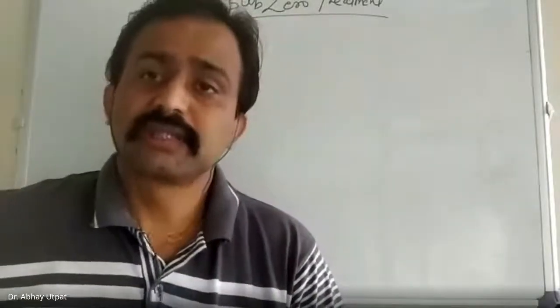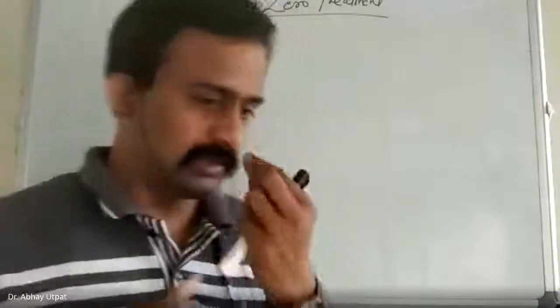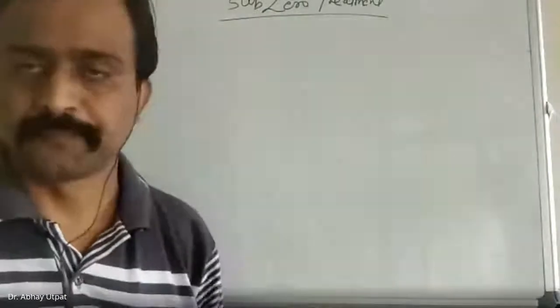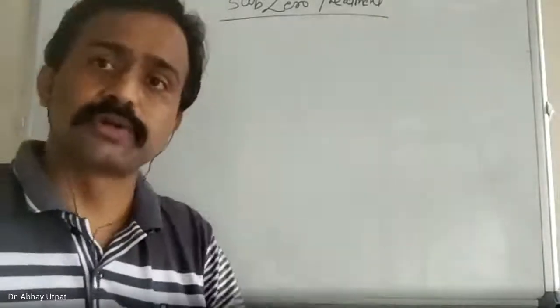Now, this martensite which is produced is never a complete transformation. Always there is some retained austenite. Why? Look at this title, sub-zero treatment. I will take you to this title. Sub-zero means cooling below 0 degrees Celsius.